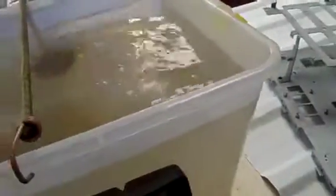Okay, so first thing you've got to do is put in your bicarb soda. This basically causes the water to become slightly salty and slightly conductive, causing the electricity to flow through it into the workpiece that you've got in the tank. I don't want to use all of this up because my mum needs some for her cooking, but I will put at least enough in to make it stronger, and I can add more if I need to.